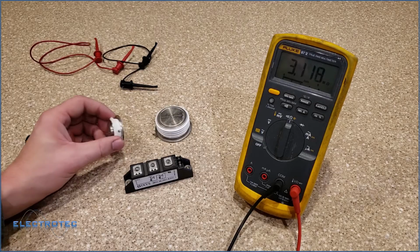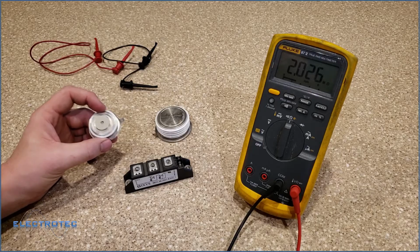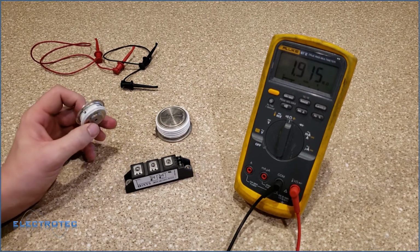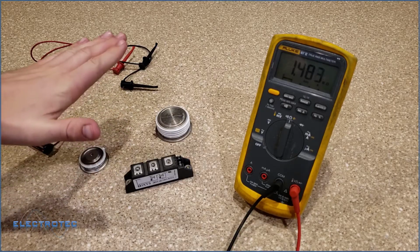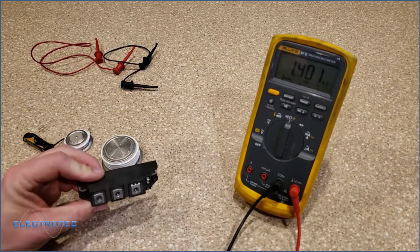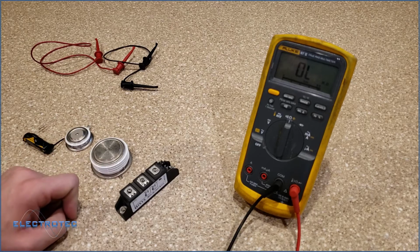So first of all, a description: I've got these puck SCRs here. A good note for you guys who are trying to check these things: every one you check, even the ones that are brand new out of the box, seems like it doesn't work. Well, that's because there is a spec on these that they need to be squeezed. These usually are in DC drive power sections, and they need to have pressure on them. There'll be a big heat sink that clamps these things down, and oddly enough, they don't work until they actually have that pressure. So that's a good thing to know. Something like this, where it's in a package, doesn't need any pressure. It's just these pucks you have to worry about, that you need some force down to actually get the anode and the cathode to touch one another.